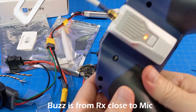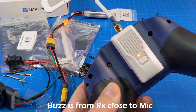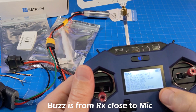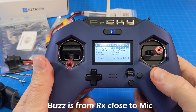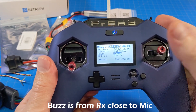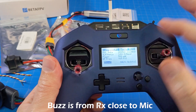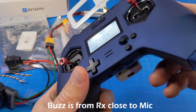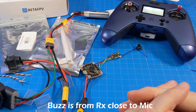The button also changes power output. This is the 915 megahertz version, so it only goes up to a packet refresh rate of 200. You need to get the LUA script off the ExpressLRS wiki page — you can see I've got the power set at 500 and the packet rate at 200, which is as high as this one goes, though that could change over time. There's also a WiFi update option for the TX, and a USB-C port on the bottom for updating over UART as well.